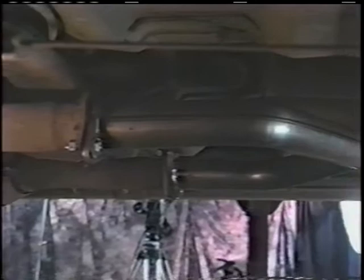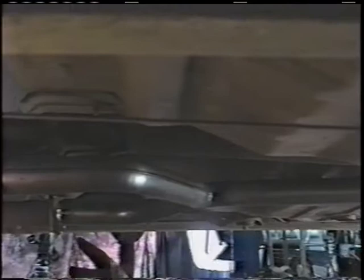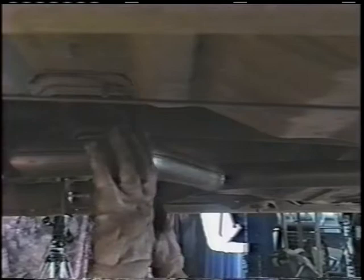We come back in then and made this crossover pipe. Same degrees as what we put in the first one. It also comes into the middle of the bend so that the flow works together. It didn't come in straight over to this side and actually cause a restriction. It's all flowing back at a 45 degree angle so that it hooks and goes back into the muffler properly.